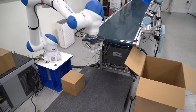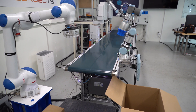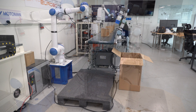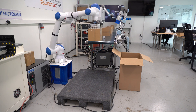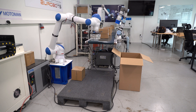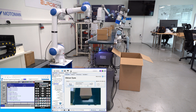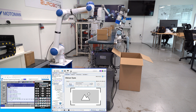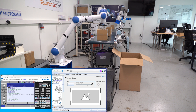If you're not familiar with collaborative robots, they are robots that can work near people. Basically, if you invade their workspace, it's not as dangerous as an industrial robot — the robot will hit you and it still hurts. But they are pre-configured to not exceed some speeds or forces, and they have more security limitations, such as different speeds in different working ranges and areas, or security planes where the robot avoids moving out of the plane.